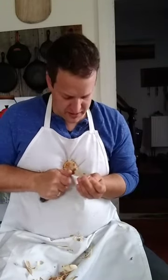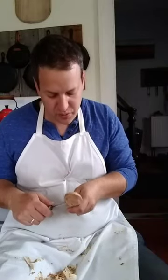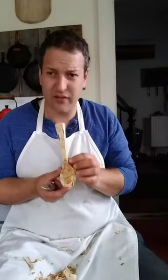So at any rate, whenever you're doing tangentially oriented carving like this, you're diving down through the layers of growth rings, and you're going to struggle more with separating those growth rings one from the next than you would in a radially oriented spoon, where, when you're carving these wide faces, and particularly on the back, what you're doing is cutting one set of cells from another across a whole bunch of growth rings at once.